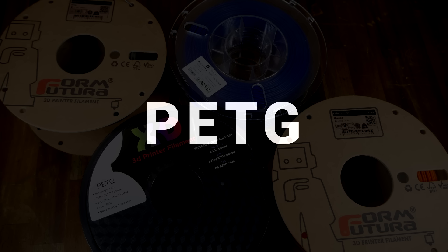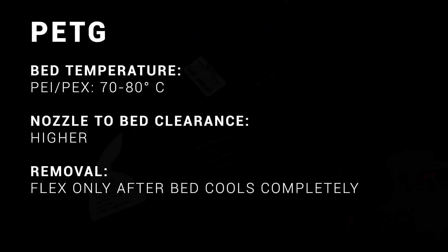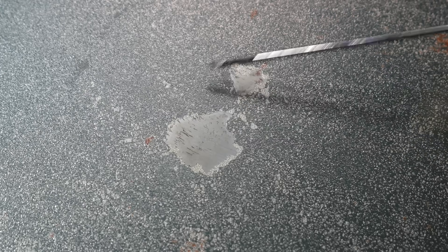Let's step up the difficulty significantly by introducing PETG — this difficulty exists because PETG can stick too well. For my printer dedicated to printing PETG full time, I use a textured PEI sheet, which the parts have no problem sticking to. For BuildTac I'd run the bed at 80°C, but for PEI or PEX I'd actually drop that to as low as 70, and I'd also recommend raising the Z offset to move the nozzle further from the bed for the first layer.